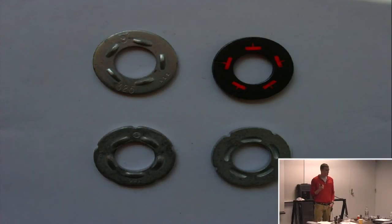And these can be either forged or pressed. One important thing, they're pretty much all pressed. These are not washers. They do not take the place of a washer. They are a load cell. That is another big important thing with DTIs: you have to still use the washer as required.